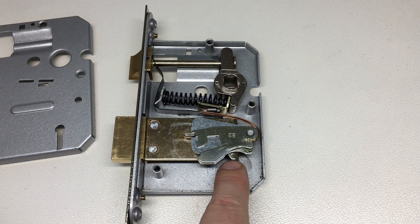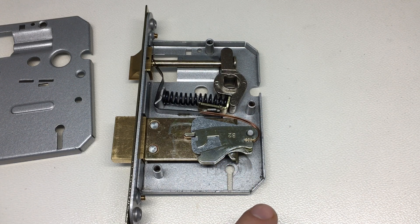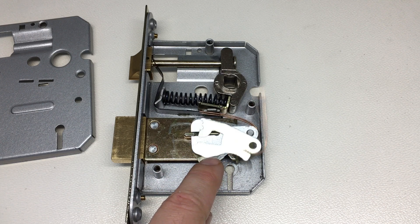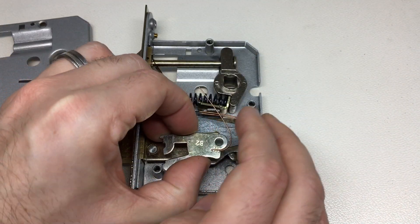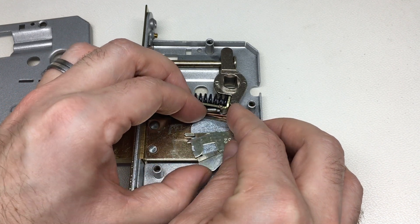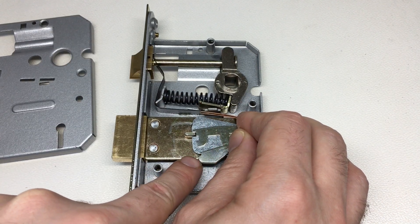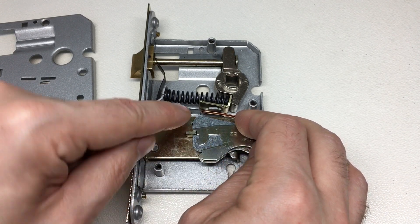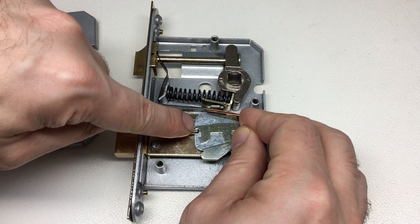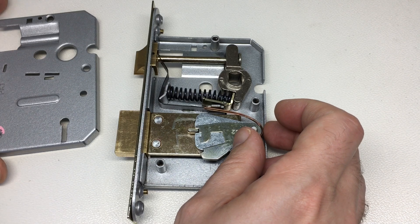You don't want to go too far towards where the keyhole is either, because it's always good to try to keep that well preserved. Same with the bottom of the lock — you don't really want to go too far beyond where the belly of the levers will lift to. I'll probably go to the bottom of where the bolt assembly is, so just about this level — really looking at a window which goes from the bolt stump across, down, and across again, just in a little square or thereabouts. Precision at this point doesn't matter too much.